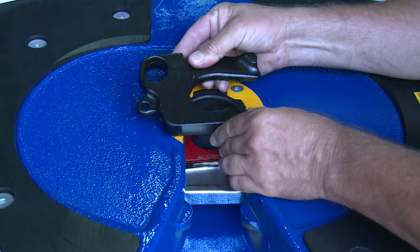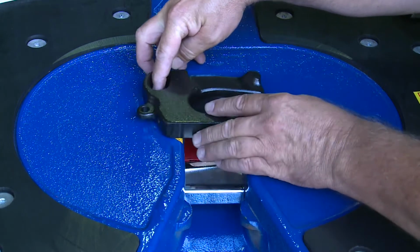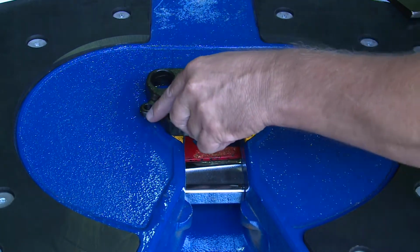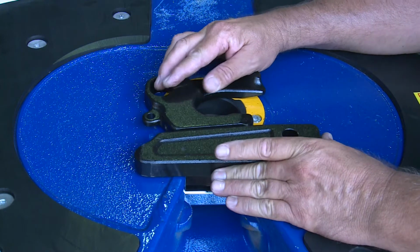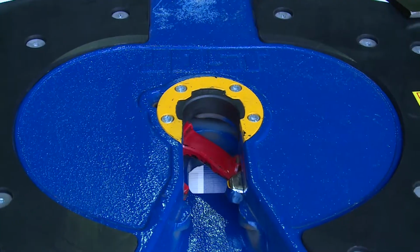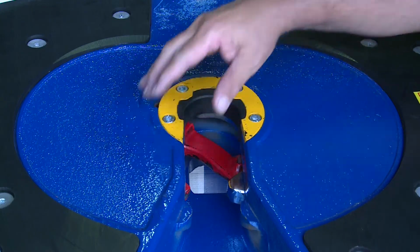We have the lock jaw. That's the red device that's located underneath. It swings open and closed. Works on a pivot pin here. And once that lock jaw is closed, our lock bar then goes across behind, and that forms a positive lock. We open the fifth wheel up. You'll see the lock bar gets retracted back out. That's allowed our lock jaw to swing into the open position.